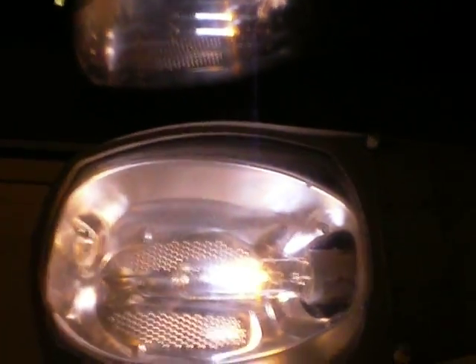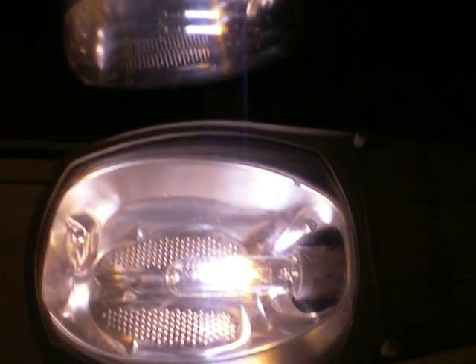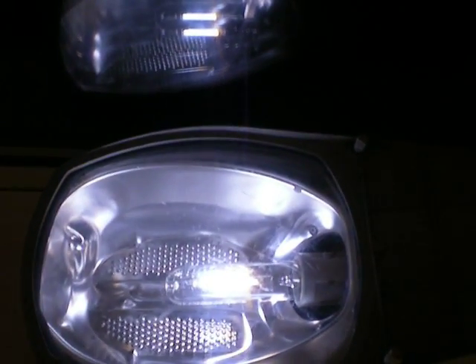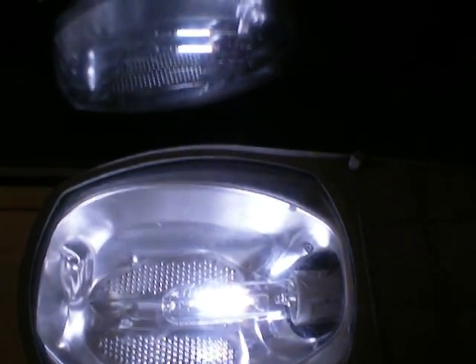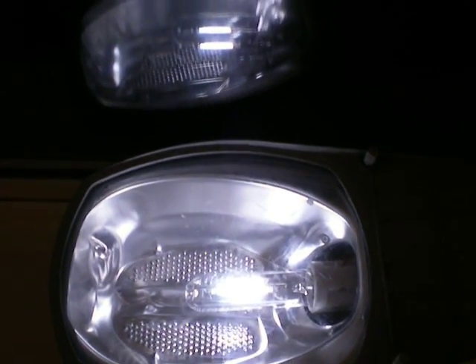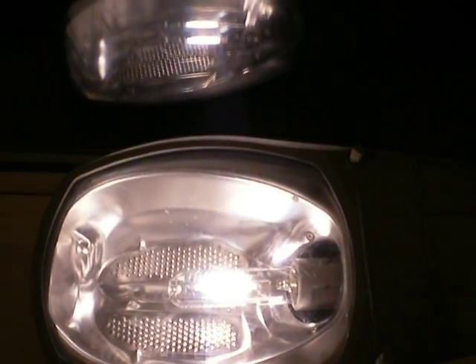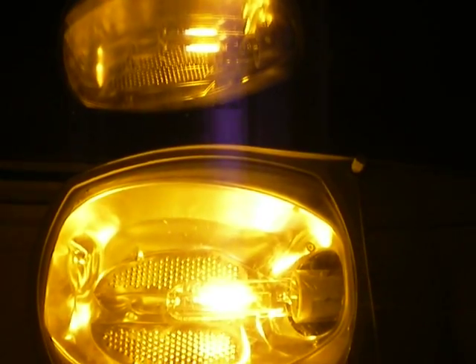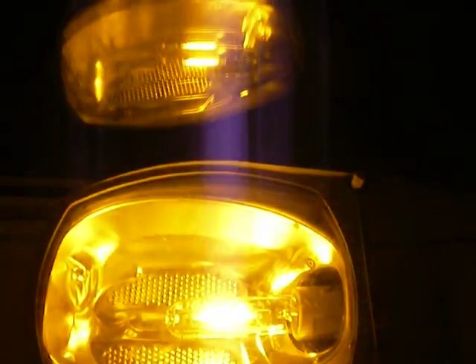The light is secure — there's the SON lamp and I'm going to switch it on. I'm ready to switch on the high pressure sodium lamp. As you see, when you first switch it on it lights up a bluish-purple colour — that's the mercury vapour inside the bulb. The light's turning more pink; that's the sodium beginning to shine. Now it's turning yellow — that's the sodium outshining the mercury vapour inside the arc tube.